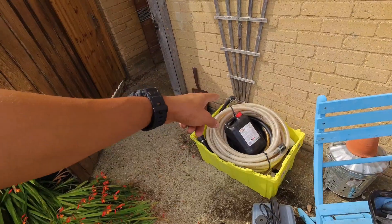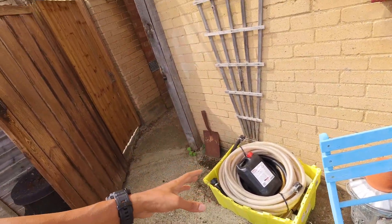This is the job that was here a couple of days ago. We've got the blocked cold feed and vent section. The plan we've decided on is to do a power flush in the system first. We're going to power flush it using FX2 because it seems pretty badly sludged up. It's an old system, the radiators are old, the pipework's pretty old. And the way the magnet was sticking to the H section, I think it needs some FX2.